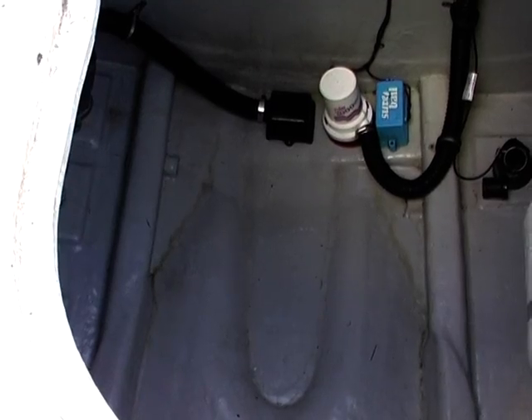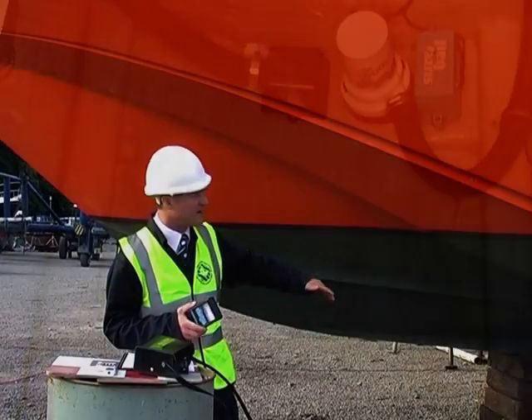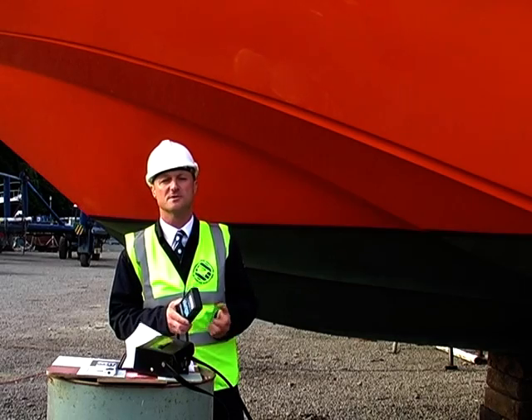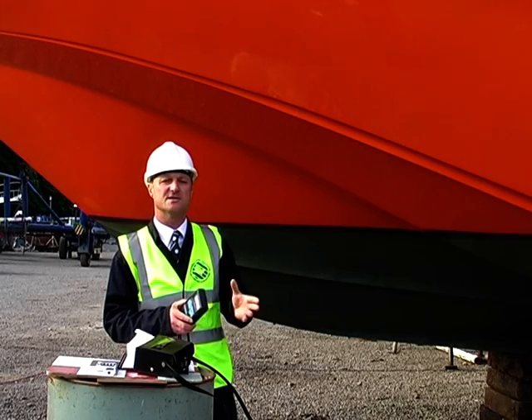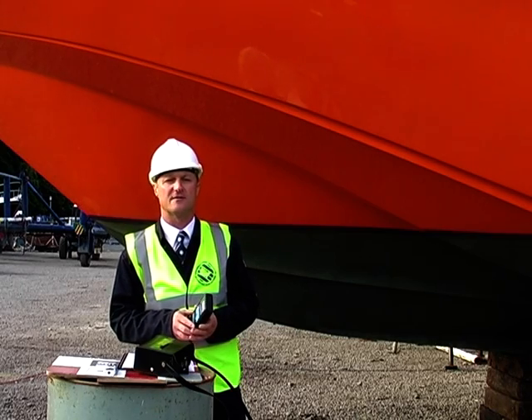As modern hulls may only be 8 to 10 millimeters thick — unless you're right round underneath the keel where you'd expect it to be thicker — even if the bilge appears dry, a small salt residue will conduct electricity very effectively, giving misleading readings. Spurious external readings should always be checked by wiping the inside of the bilge with a bit of fresh water and drying it thoroughly.